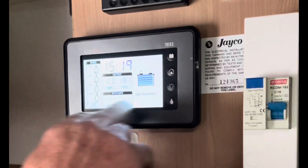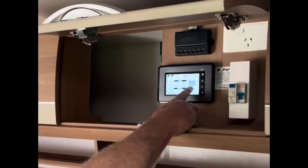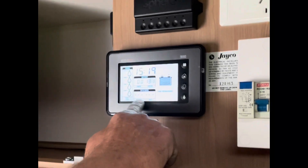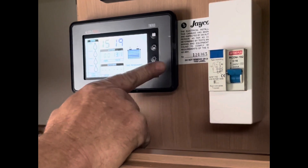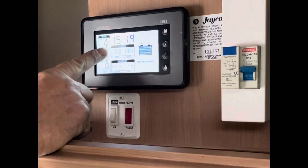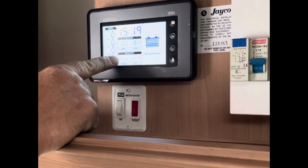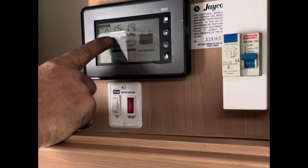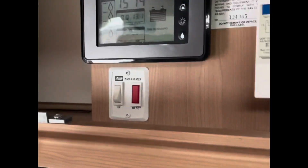It should go back to zero. Being that we're not using anything or making anything, we don't have a time remaining because the battery is in standby. If there was an input coming in, it'd say charging, and it gives you the amount of current coming in for either solar or auxiliary. If we had lights on and solar coming in making four amps while using two, we'd be in a charging status. When we're using more power than what the solar can create, it'll go into discharging - but the system's pretty smart, it'll just do what it needs to do.